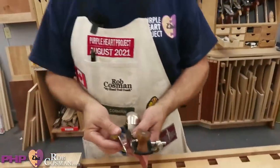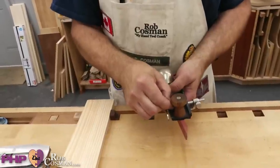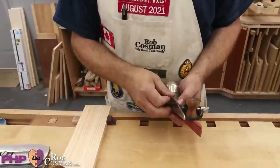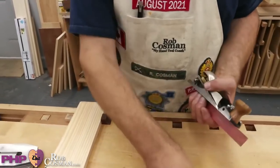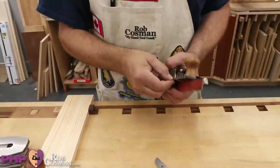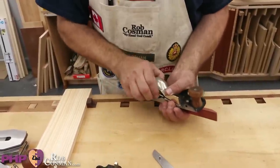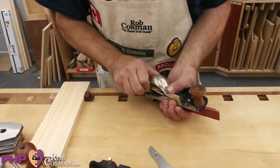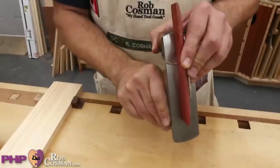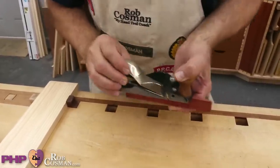Yours. So that's held on there with these two screws and these pins, and it's a regular block plane of sorts. When you take this off, it exposes the blade. And by exposing the blade, you're now able to make a cut that brings you right over to the edge. So what I would do is set this plane up so that the blade is sticking just beyond the edge. I sight down the sole to make sure that it's parallel to the sole, lock it.